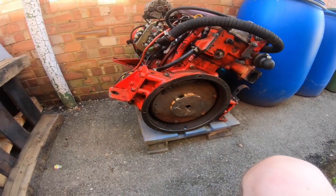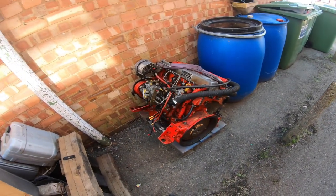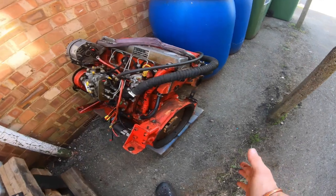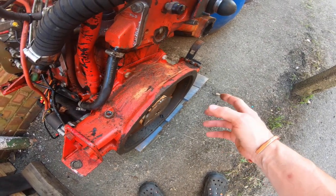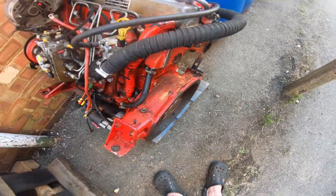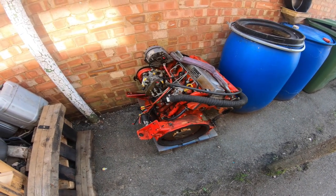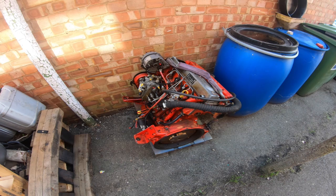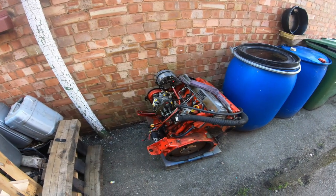So one engine that's now done — going to replace it with something else. It's served its time and unfortunately it's not viable to save, so it's going off to the scrapyard. I hope that was a little bit informative. Drive plates are a very important bit of kit — always sandwiched between the engine and gearbox. The gearbox registration or adaption plate bolts to the front here, and the gearbox — whether it's a PRM hydraulically cooled box or a mechanical TMP — sits there. I hope that was helpful. Please consider subscribing, and take care — see you later.